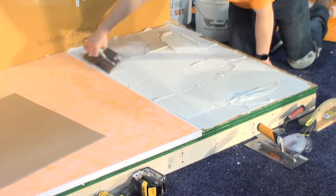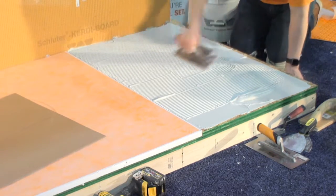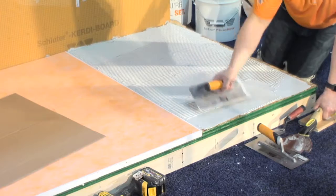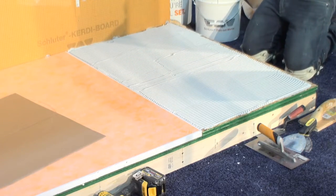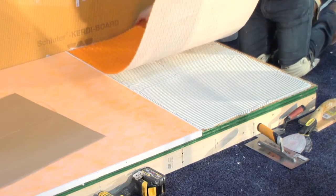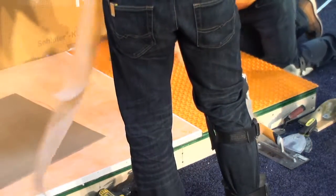We no longer had a mechanism for uncoupling built into there, so it was Schluter Systems and Werner Schluter that said, we really should look at the benefits of having an uncoupling system or mechanism built into a tile assembly. So what is that? That gives the tile the ability to be uncoupled or not be affected by dimensional change of the substrate below the tile, what it was typically being bonded directly to. That's a force conductive bond. We don't want a force conductive bond between two dissimilar materials like wood and tile or concrete and tile or anything like that. So we wanted to actually get that uncoupling layer in there, a forgiving shear plane layer, and that is what DITRA does.